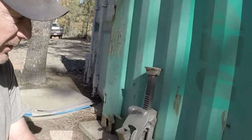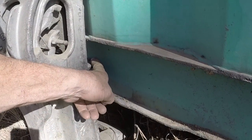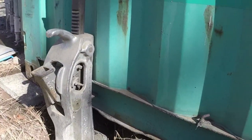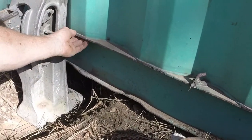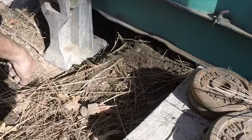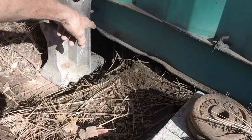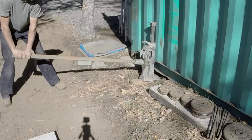So I put it under the bottom — didn't work. I see why: this flange bent, allowing this to slip off of it, probably because the way I was pulling was pulling the top of the jack out. So what I'm gonna do is set this back up underneath — when set up under the box, it won't bend because it's got the wall on top of it holding it in place. Now these two-by-fours have been stuffed into the ground pretty far, so I'll get a four-by-four, stick it on top of those, and then we should be high enough up to pick this thing back up.